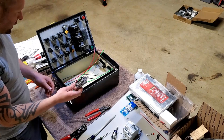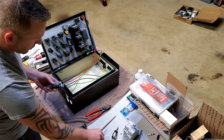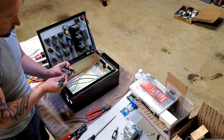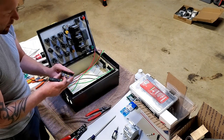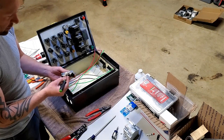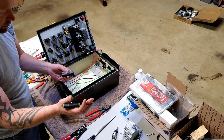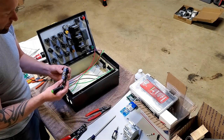Here's the 15 amp, 120 volt. Like I mentioned previously, I think they're one. So these come tied together to make this single switch or single hot or whatever. You can break these. Keep the neutral link because that's the other side of the circuit. And then I only have to run one wire, one ground.